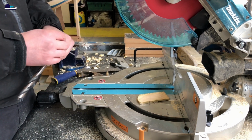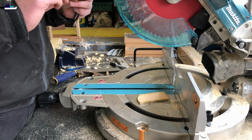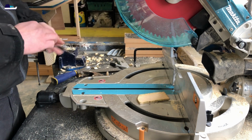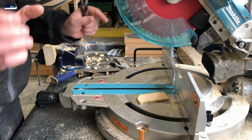So what I'm going to do is, at 100mm centres, put through, I think this is an 8mm bit first, check the centres, and then put through this 12mm bit afterwards, which will give me plenty of capacity for whatever bolt, and if I'm slightly off, it gives me a little bit of wiggle room.